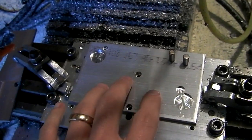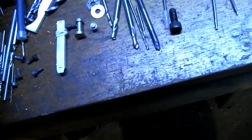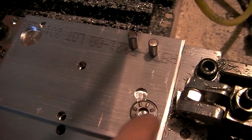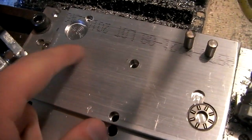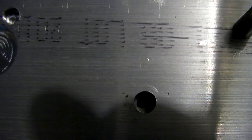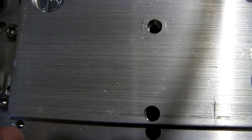So I'm making the handles for my knife. This is the back side — these are where the bearings go. These are the bearings, they fit fine, which is great. And this is a relief for the button lock, same for up there. So I make this plate, and these holes are supposed to go through and be totally lined up. But as you can tell, those do not line up whatsoever. In the machining world, that is stupidly off — crazy off, unacceptably off.